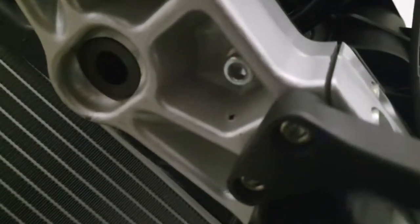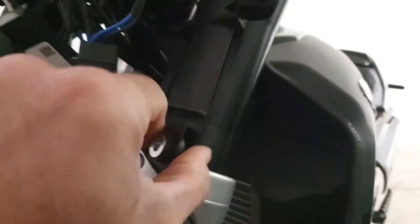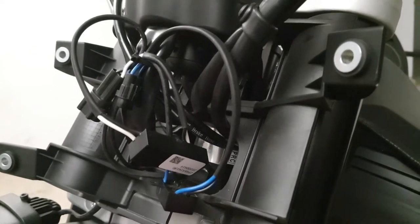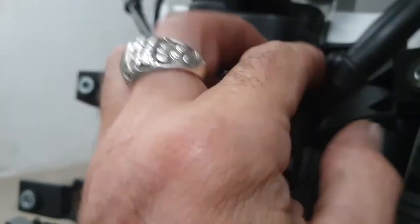From underneath you can come in with a 6mm bit. You can just see you've got one there and one the other side — undo these two nuts and bolts and that should loosen off. In order to get to the other two button-head Allen key screws, you need to remove this part. There's a button head each side and around the other side as well.